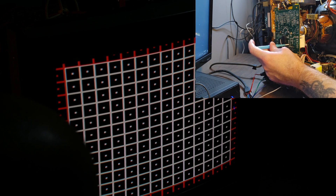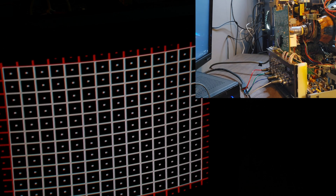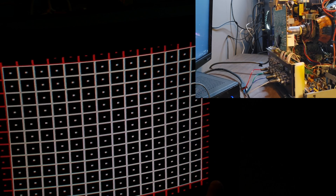That focus pot — you can access it through the hole in the back of the neck board or you can access it from the front. My screwdriver kept slipping, so I'm just getting my hand in there and turning that knob. You can see it shift from focus to out of focus right there. It's pretty dang sharp, so that's where I leave it.